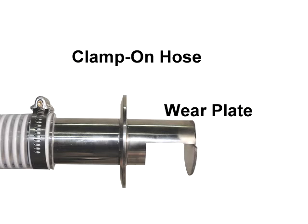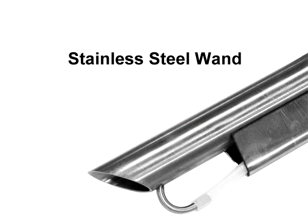They even have a hardened wear plate that eliminates wear to the chamber. We used to have to replace the cyclone on the loader running glass-filled material a couple of times a year. I just talked to one of AAE's customers who had the same problem — he bought a loader over four years ago and still sees no sign of wear. Even AAE's accelerator and wand are made from stainless steel; they're the only company I could find with good wear resistance. Remember the time we got ceramic chunks in our material from that aluminum accelerator? That was a nightmare.